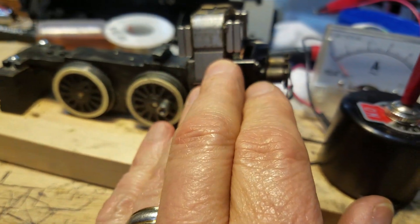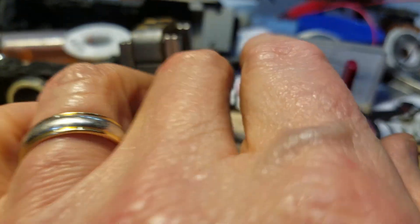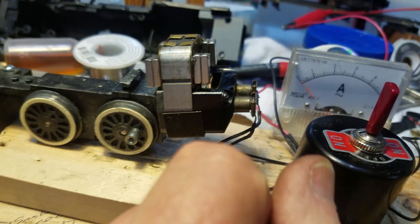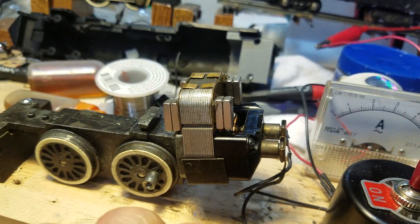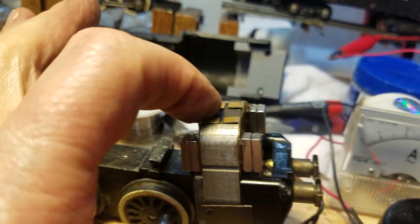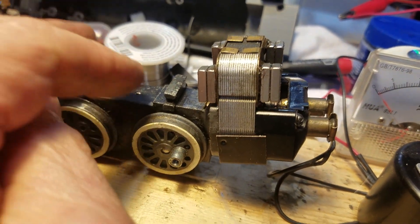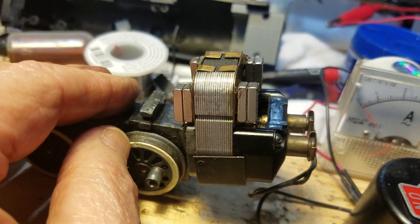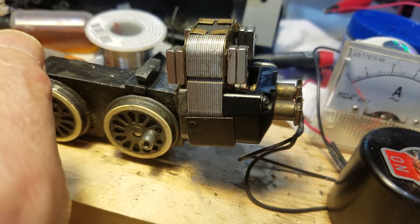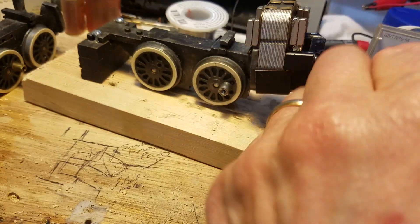When I first got this motor and put it on the grid, it would hardly run, and when it did, I had to help kickstart it — it was running about 3 amps. Since then, I've added some super magnets to the original magnet, which had seemed to have lost quite a bit of its zip. It's a 1948 motor, so it's a 60-year-old magnet. Permanent magnets are not permanent.